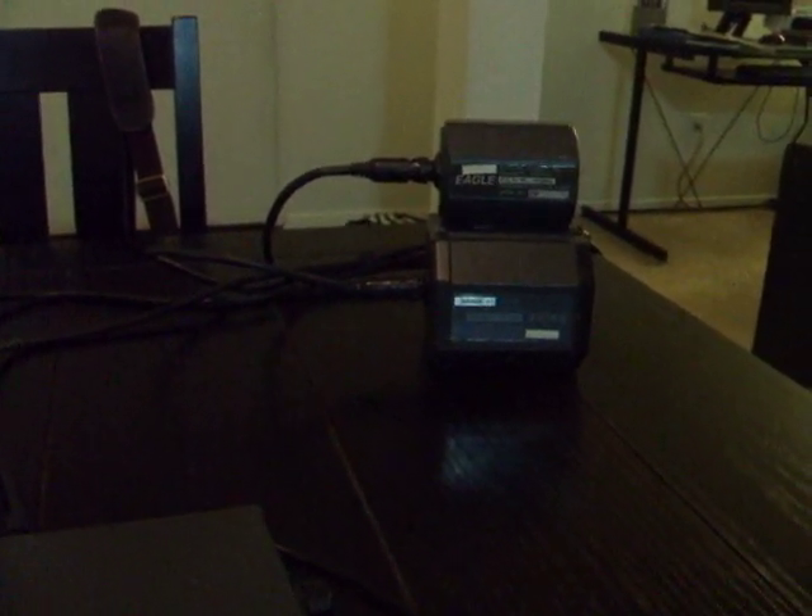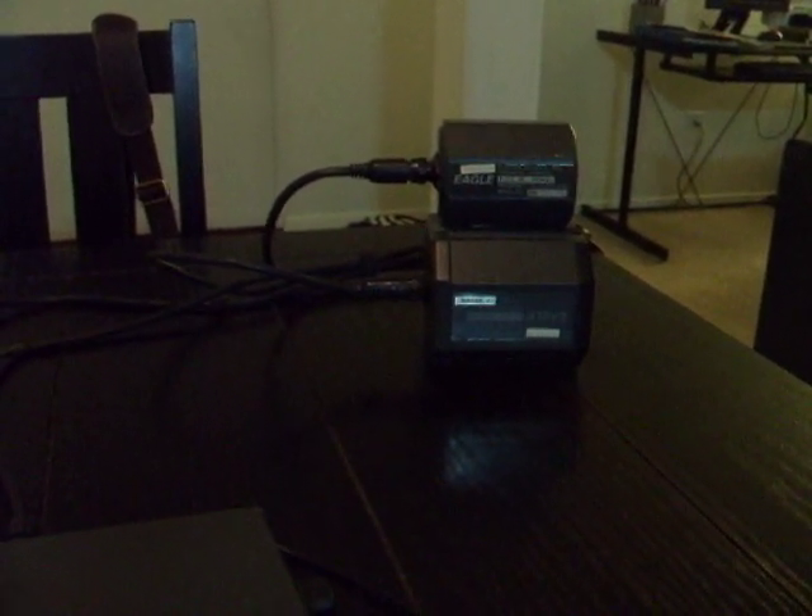We're using the Custom Signals Radar unit, one of my favorites, because you can switch antennas easily on this unit. You can run both a KA band and a K band antenna. On top we have the smaller 35.5 KA antenna, and on the bottom the larger K band antenna at 24.150. With the front antenna selected we're going to be shooting KA band, and when we switch to the rear antenna it'll be shooting K band. We'll toggle between the two just to ensure the detector doesn't park on a frequency.